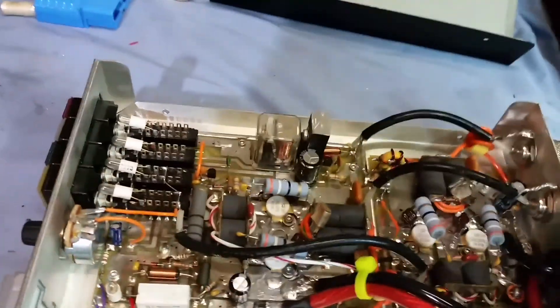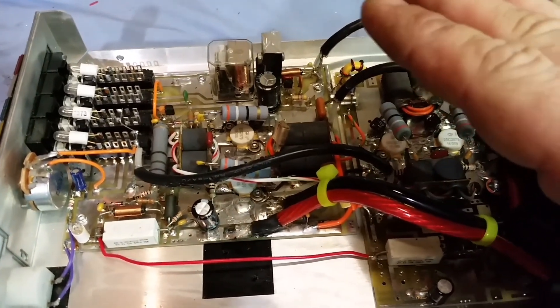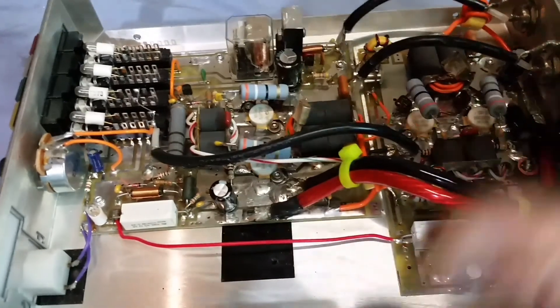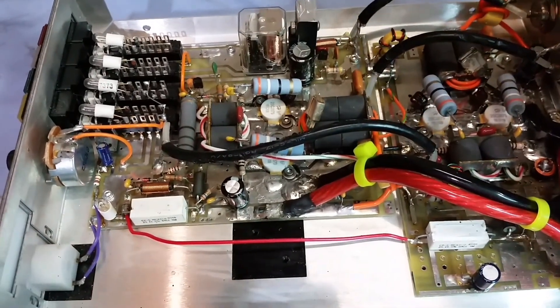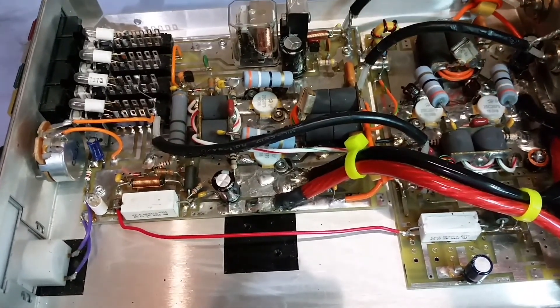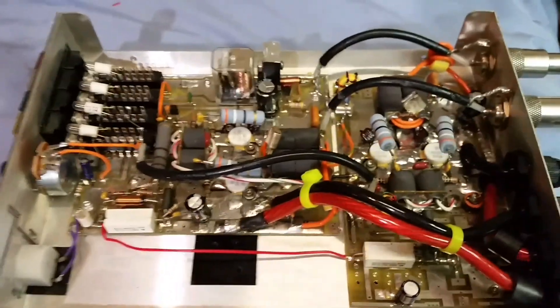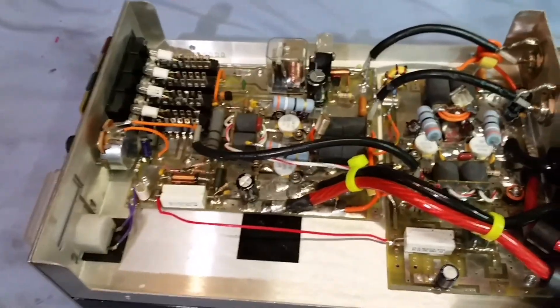The only other thing I did was add a little capacitance to the input splitter. The reflected power looked fine, but going from whatever was in here to HGs can cause a little fluctuation. I only had to add about 25–30 more picofarads, so the input splitter now has roughly the same capacitance as if this were a 667, since the driver's output shares a tuning capacitor with it.